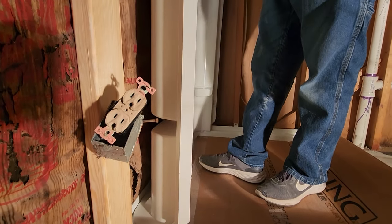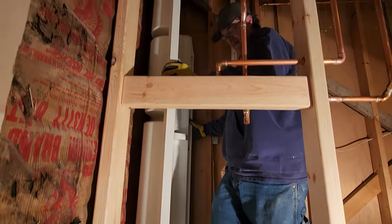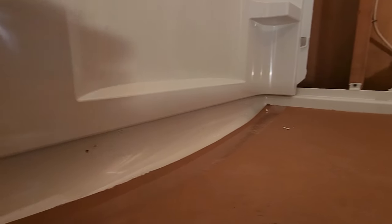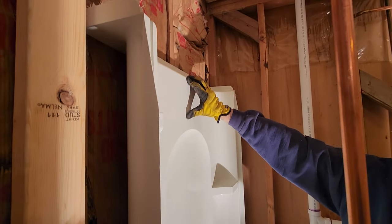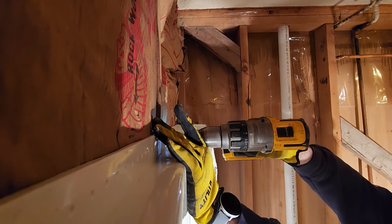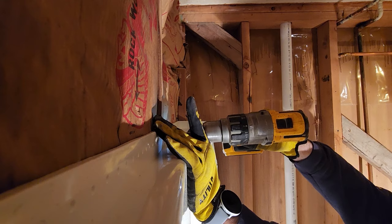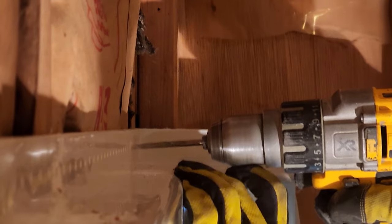Here's the procedure: you've got the base in and everything's good. First thing you're going to do is install the back wall. This is a hook system that these walls use. Get the back wall in and fasten it to the studs. What we like to do is pre-drill the holes with about a quarter-inch drill bit first. Nice and easy — don't push too hard; remember, you're dealing with plastic.